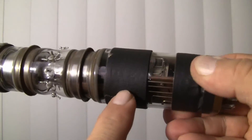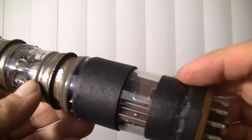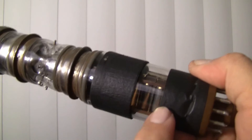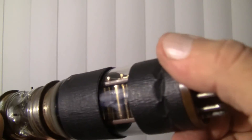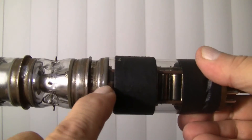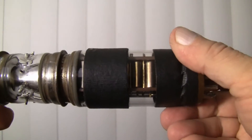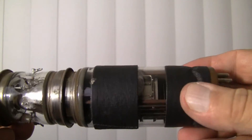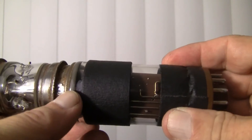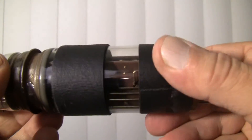I don't want to remove this tape as it's historical, so I'm going to leave it on. But for people familiar with photomultiplier tubes, you can easily see that this section is a series of electrostatic electron multipliers. The image electron that passes through the aperture ricochets down a line of these metal plates — each one is 100 volts more positive than the last one. As the electron goes, it strikes the first plate and knocks out say two electrons, which strike the second plate and knock out four electrons and so on.